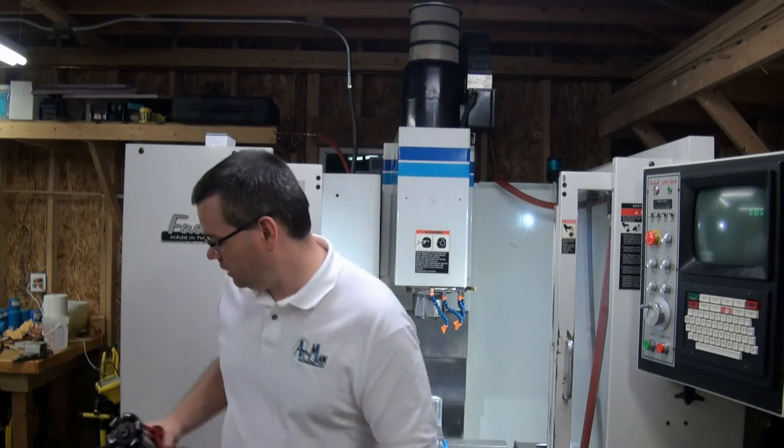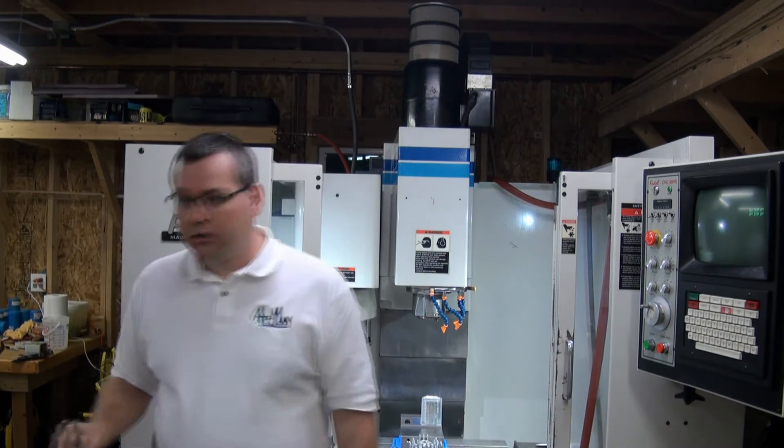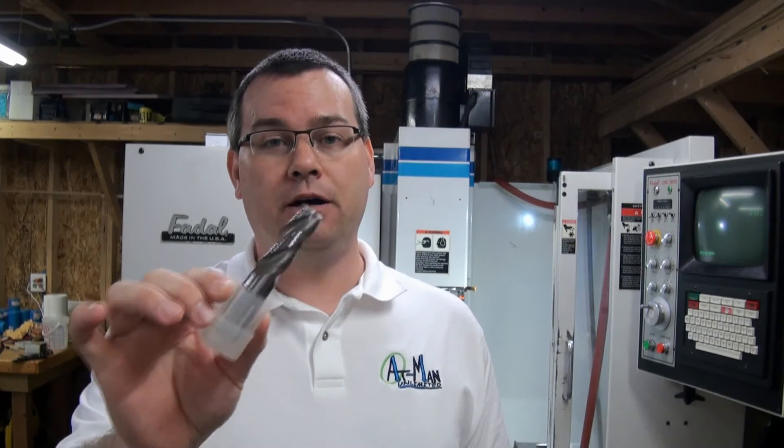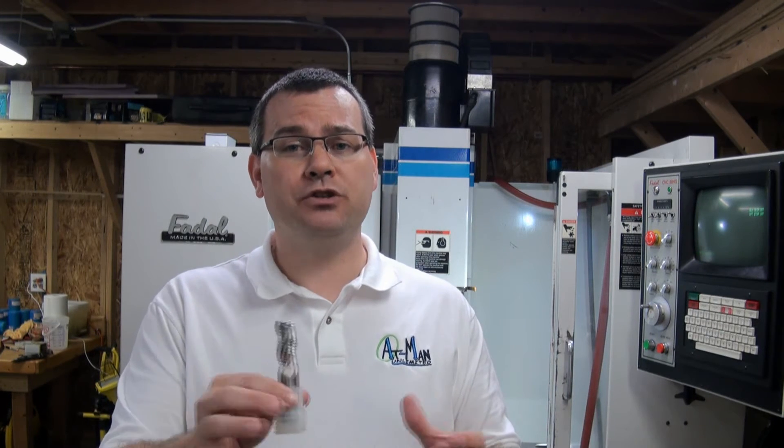You can more than likely make your part just fine using a smaller tool — it will just take longer. If you're okay using three-quarter inch end mills, which is probably about the largest I would recommend on a personal CNC machine, and you're okay using a one to one-and-a-half or two-inch style single-flute fly cutter, then a personal CNC machine is just fine. You'll be able to get good results and make good parts. They're more than accurate enough for the average person's needs, so there's nothing wrong with a personal CNC machine.